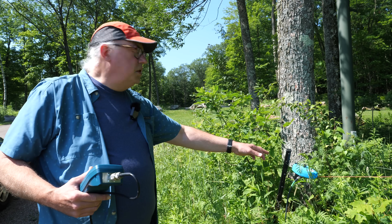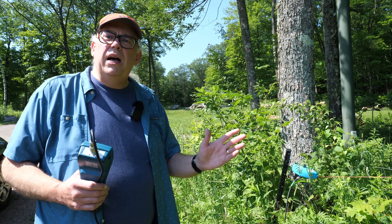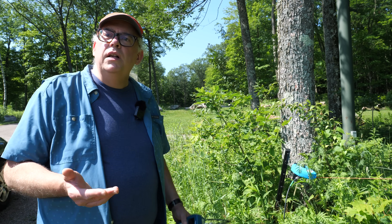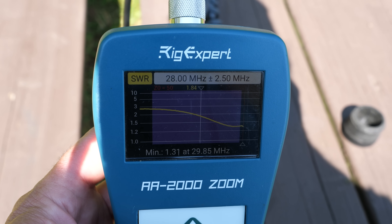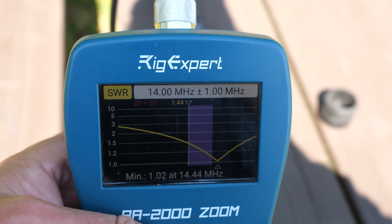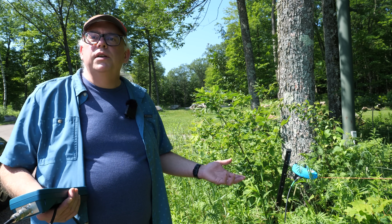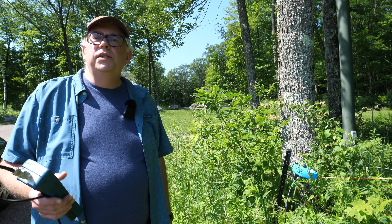I ended up doing about five or six turns on the reel to shorten the antenna, and that moved my resonant point from the bottom of the 40 meter band to about midpoint. It moved the resonant point on 20 meters slightly above the band, but bandwidth is good enough that on both bands I'm 1.3 to 1 or less. I'm not going to fiddle with it too much — I just want to set it once and forget it and not worry about micro adjustments every time I switch bands. Your particular deployment will be a little different depending on your location, ground conductivity, and similar factors, but anywhere from two to six turns will probably get you the results you want.